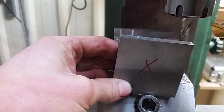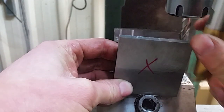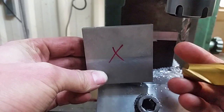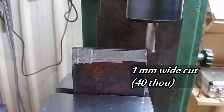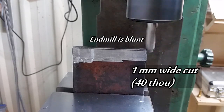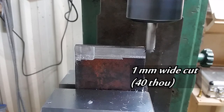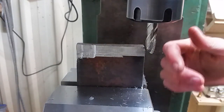To mill safely on the side of tall plates I choose to climb mill. It's much safer because when the end mill first touches the plate it only pushes the plate away rather than sucking it into itself. To climb mill on a manual mill safely all you have to do is feed slowly enough that you stay in control. You can also partially lock a slide if you feel the need. Let's also do the same one-millimetre depth of cut feeding the other way — conventional milling — for comparison.